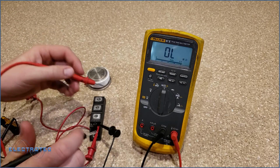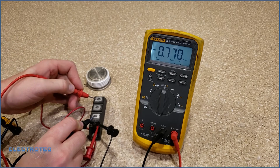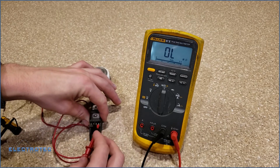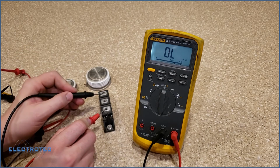And if I read this backwards, we're going to get that negative resistance reading, which just means power from the batteries getting into the meter somehow. 0.896 mega ohms. We never actually checked that one in its off state. So I'm going to disconnect that. I'm going to check that one in its off state quickly.